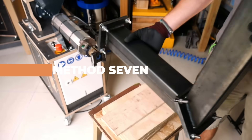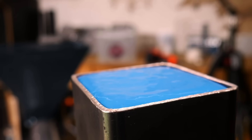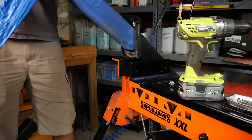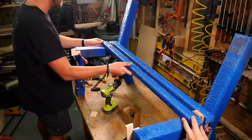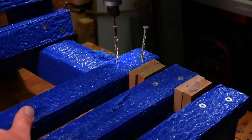So far we've shown you techniques to make relatively small products out of recycled plastic, but since there's still 300 million tons of plastic being produced every single year we thought we'd show you a technique that uses up a lot more plastic. This is our extrusion machine — whilst it's one of the smallest of its type, it's designed to pump out a continuous stream of molten plastic, like a large-scale 3D printing nozzle. While our injection molders have a limited volume per shot, our extrusion machine could fill much bigger molds. Molds for this machine can be made pretty inexpensively — it's standard box section steel with a plate welded on one end. Essentially this machine can make the raw materials needed to make larger items like furniture. This 30 kilogram bench was made from about 10,000 face masks that were sterilized and then turned into pellets. Another great thing about this material is that it doesn't have any natural grain or defects such as knots like wood might do, so you can simply bolt and screw it all together.